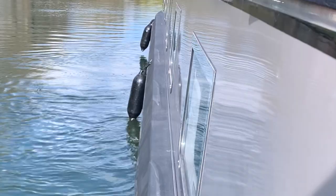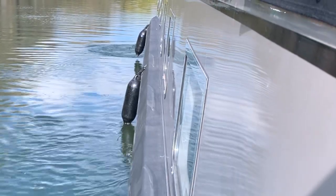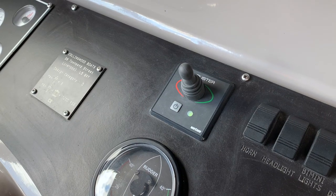We've just been through Shepperton Lock. It was a height of excitement because our bow thruster is now fixed, so Richard could actually use it to help get on and off the lock landing and over to the side. On that point, you do have to be careful using the bow thruster - don't hold it for more than about five seconds. If you hold it and after about 30 seconds that green light will start flashing red, meaning you're overheating the motor. Just use it but don't abuse it - unless you've got a hydraulic one.